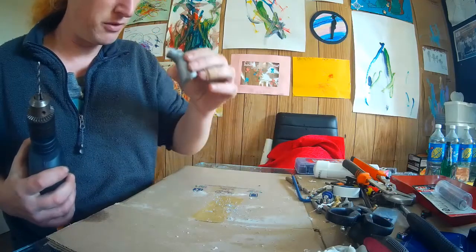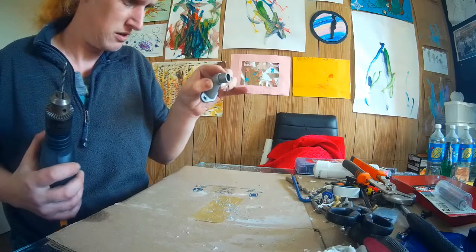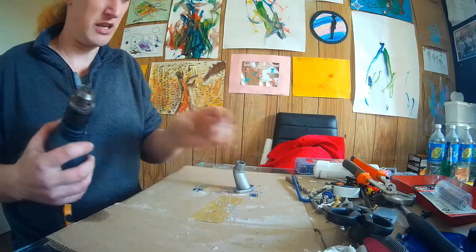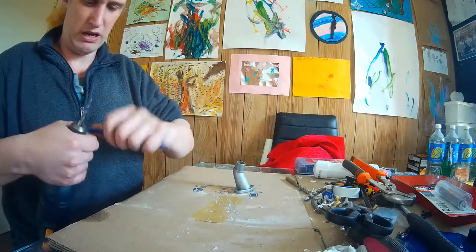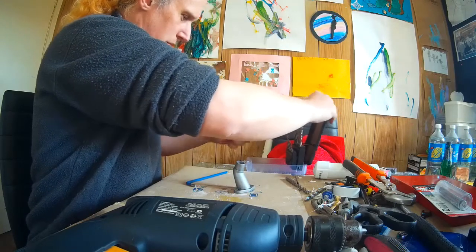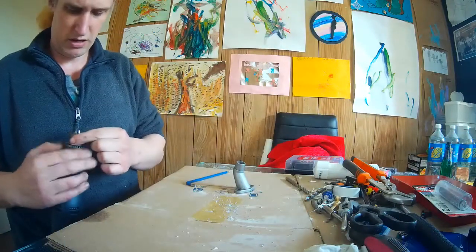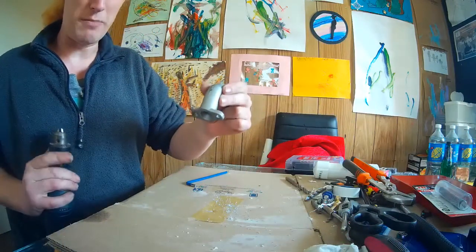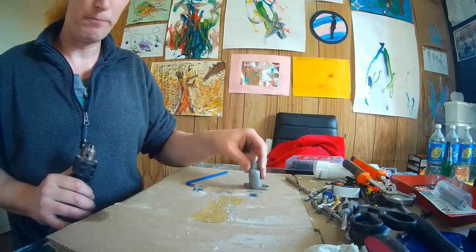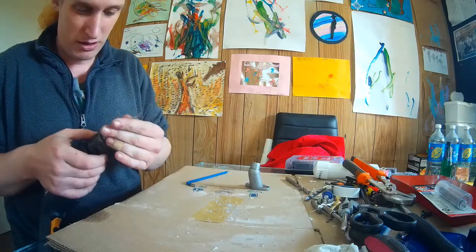Do have to be careful not to punch the other side of the intake. Look, that's fairly center. I'd be happy with that. We'll just keep going up incrementally a mil at a time, I think. This is really, really weak metal. I don't want to put too much stress on it. The last thing I need is for that to crack. Although I've got enough JB Weld there to probably make my own manifold. Let's not test that.